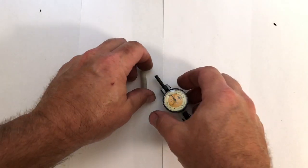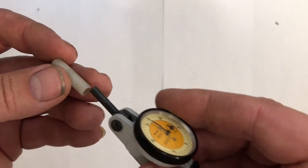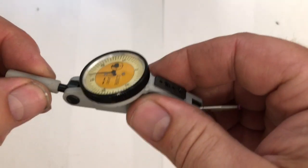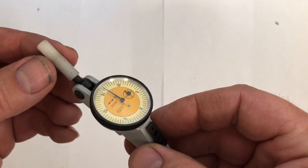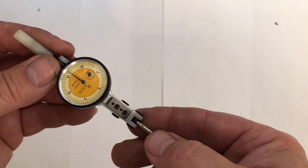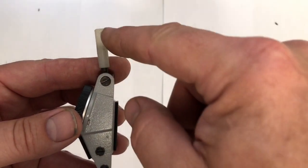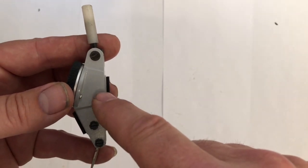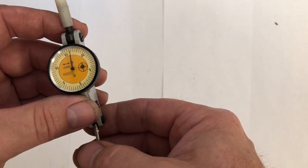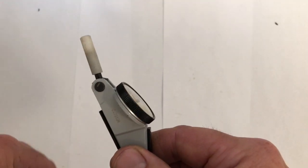Indicator insulator. It's this little piece of plastic tube — actually a piece I machined — that slides over and fits onto the indicator. If you work on an EDM machine that has a current running through as crash protection, these indicators have a tiny coil spring inside. When that electrical current runs through your indicator it can heat and anneal that spring, so after a few months of use your indicator may not return back to zero. Some CNCs also send a current through as crash protection, so be careful.